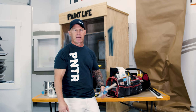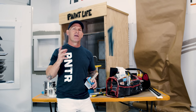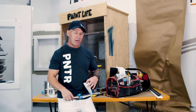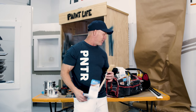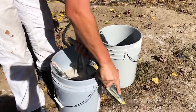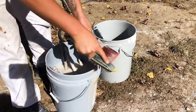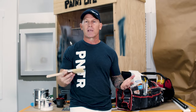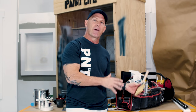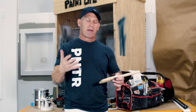I'm going to start on the outside of the house. Today's exterior paints dry really, really fast. Where I live it's pretty hot in the summer and very dry, so guys tend to ruin paint brushes really fast because they don't clean them often enough. It's really good practice to clean your brushes every hour to keep them clean, because brushes are expensive. You should buy really good brushes — you're only as good as your brush. But nowadays, because guys don't clean them, the paints dry fast, coagulate on the bristles, and just make a big mess.